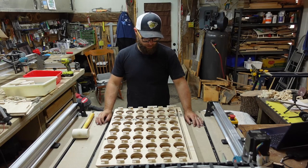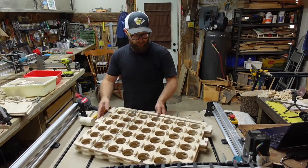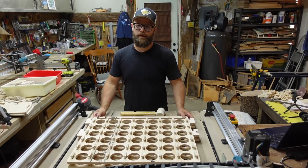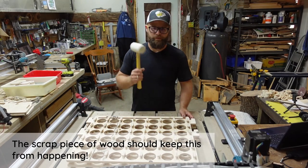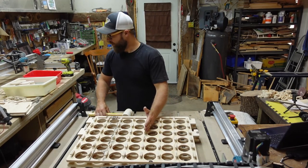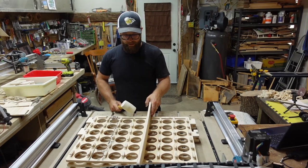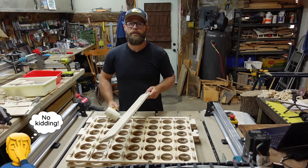Well, all right, so I wasn't lying. That was not a whole lot of fun, but we got there. Now, the good news is they all lined up, except for that one. The bad news is there might be a couple of non-survivors there that I may have motivated a little too heavily with my mallet. So if you're going to do it, you may want to find a scrap piece of wood, preferably not one of your pieces that you're going to use. Oh man, I wish I would have thought of that. Yeah, that works a lot better.